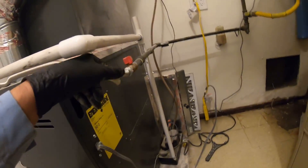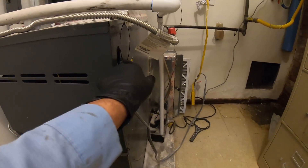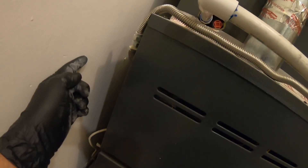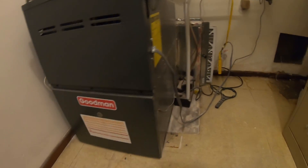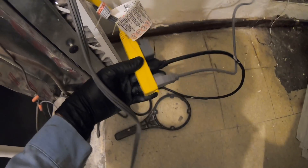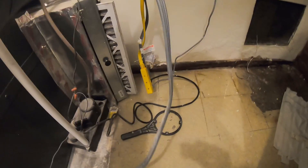I'm just gonna note the things I would have done differently, which is this gas line. I would have probably come out through here going into here, or I would have gone all the way to the back. Well, at least they hard piped it out - that's a good thing. A Romex connector here would have been nice so that this doesn't vibrate and cause a short for the low voltage in the future. It did use a Romex connector here but they didn't tighten it.